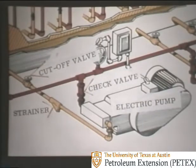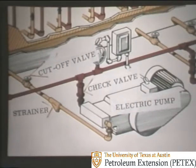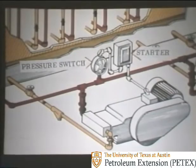The electrical pump is similar to the air pump. The yellow suction line leads from the tank to a cutoff valve, through a strainer, and on into the chain-driven electric triplex pump. It is chain-driven because chain drive is more reliable and safer than belt drive. The red lines show fluid under pressure leaving the pump, passing through a check valve, and onward to the bottles. A pressure switch starts and stops the electric motor — cutting it off at about 3,000 PSI and cutting it back in at about 2,700 PSI, just like the air pump switch.